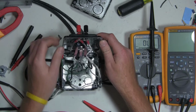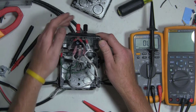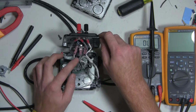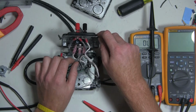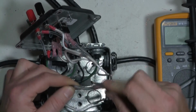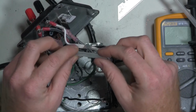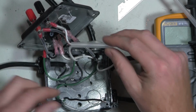So I made a rookie mistake. I forgot to energize one side of the common on the second pole. So I think I'm going to do another splice off the hot leg over to here, and that shouldn't take that long. I'm just going to put one tube of heat shrink as opposed to doing the smaller ones like I did here. I think that'll be sufficient.